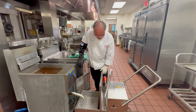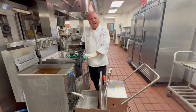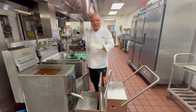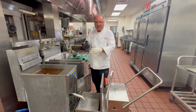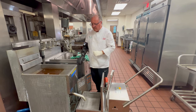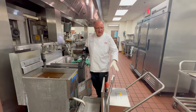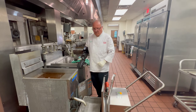We are going to shut the gas off, just in the off position. The pilot light can stay on, that's not a big deal, but we don't want to filter with 350 degree oil hot, running the fire on, because then it's going to light like a candle when there's just a little bit of oil residue on the elements. So we're just going to shut it off temporarily, but we must filter at 350 degrees. You do not want to filter microscopically at 200 or 250 degrees. It's got to be at 350 degrees.